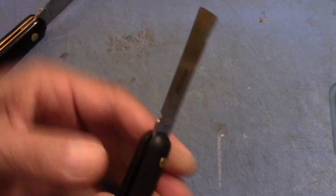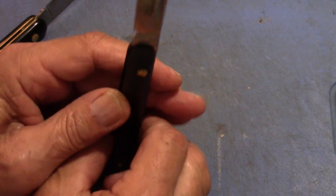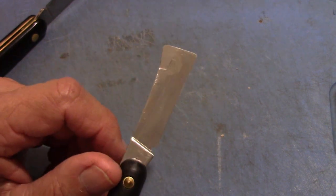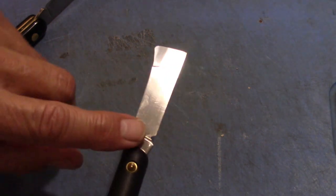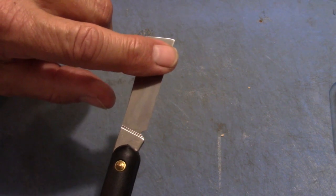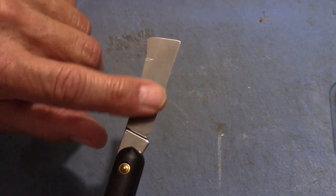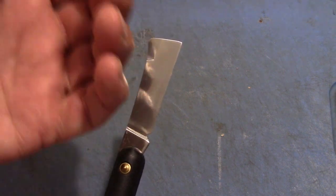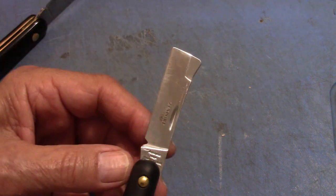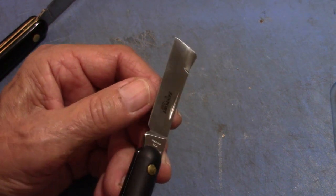On the Zen port, if you look close at the blade, you can see that it is tapered or beveled from both sides. However, in the attempt to make it a grafting knife, this one side only has a continuous bevel, and when I feel in here, right in this area, I can feel grabbing on the edge, like nicks, where the pieces of metal are sticking up. Looking on the other side, a continuous bevel. They do have it polished real nice.